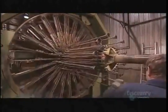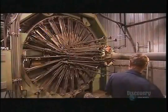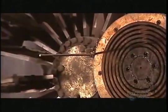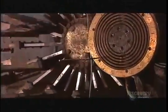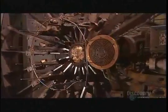Meanwhile, workers use a special machine to build what's called the cage, a circular steel frame that will form the pipe's internal structure, its backbone. They insert 2.5-meter-long steel rods in a circular configuration, pushing each rod partway through the machine to the other side. There, an automated spot welder fuses a steel cable to one rod. Then the machine begins turning, winding the cable tightly around the rods.